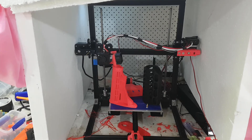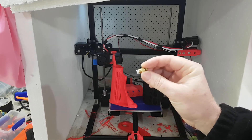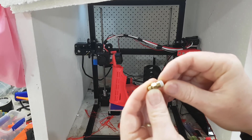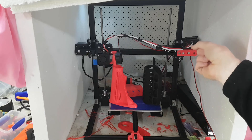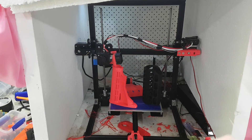That's about all for today. The other thing I did was replace the tube fitting — the tube going through there had too much movement, about this much, which was affecting retraction. I got a 6mm one like the one used elsewhere on the machine, and that grips it a whole lot better, eliminating that play. Alright guys, I'll see you on the next one — subscribe if you want, don't if you don't like me, but you do like me. Bye!